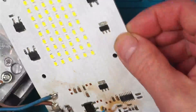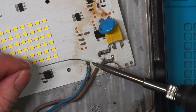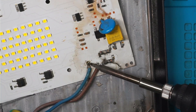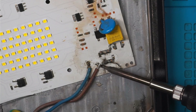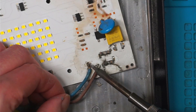There's nothing on the back. I wonder if I can desolder these two. I don't know if these have been spot welded on here, but my soldering iron is just not touching. I've set it at 400. It's having zero effect, so they may have been spot welded.